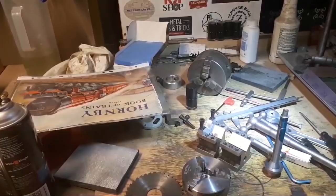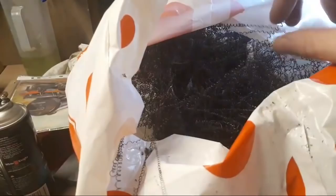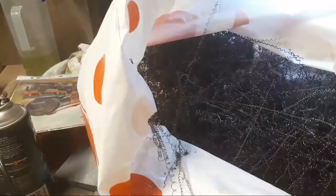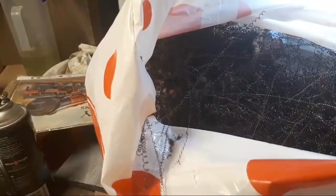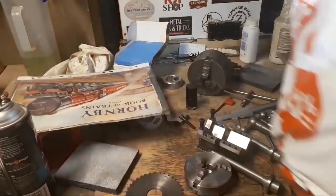We want to have a look in the swarf bag, which is where we're at the moment. I haven't actually tossed it, but there's a lot of this stringy blue swarf. It's not even sharp, it's just crunchy, and it breaks very easily because it is a tool steel. But that's what you get off D2. It's treacherous stuff. Getting a chip break is pretty tricky, especially on my machine. We haven't really got enough horsepower. So yeah, new one would be nice. But we've got that job done. And that's just off one of them. There was another bag off the other one.